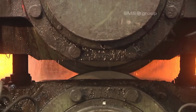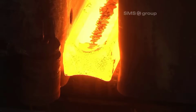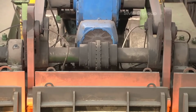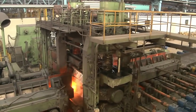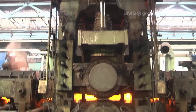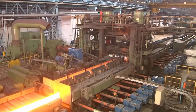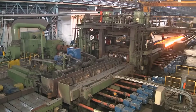Once the billets are thoroughly descaled and cleaned, they are ready to enter the roughing train breakdown mill, commonly referred to as BDM1. Here, the first breakdown mill stand plays a pivotal role in reducing the billet size through multiple passes. This reduction process is carefully controlled and monitored to ensure safe and efficient rolling. Additionally, the billets are turned using a hook-type tilter to facilitate uniform rolling and maintain consistent quality throughout the billets.